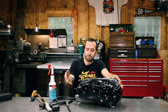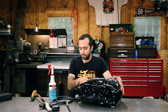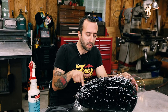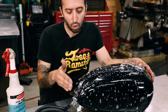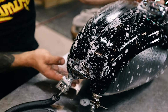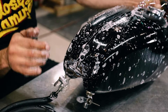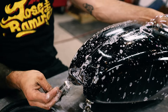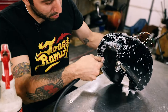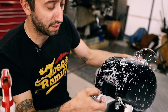You could have some that leak out of the fittings and other areas like that, and that should be okay because they might just need to be tightened up. What we're really looking for is leaks at any kind of weld seams — it's not typically going to leak in the middle of the gas tank. Where it's going to leak is anywhere where two seams come together or where fittings were welded on. If you get bubbles around your fittings, just wipe them off to make sure they're coming from the threads and not the weld close by where the fitting attaches to the body of the tank. So we got some around this, but those are just coming from the threads — this just needs to be tightened up and sealed properly.